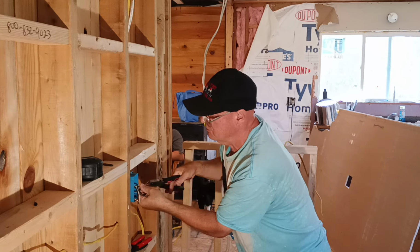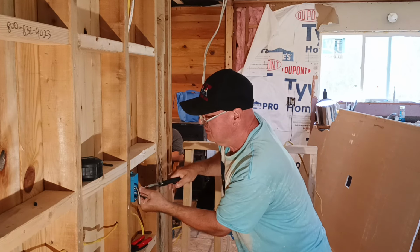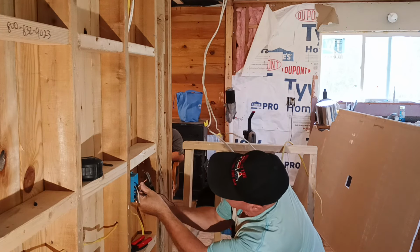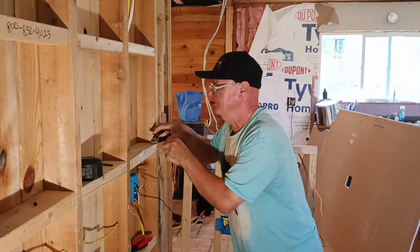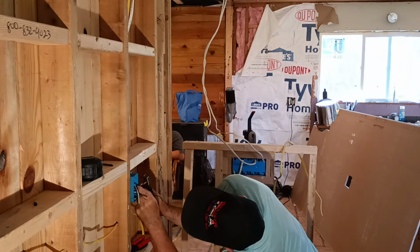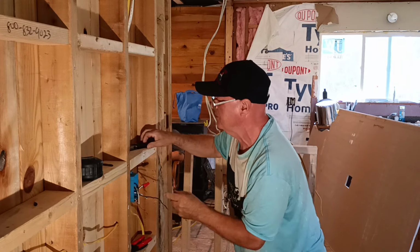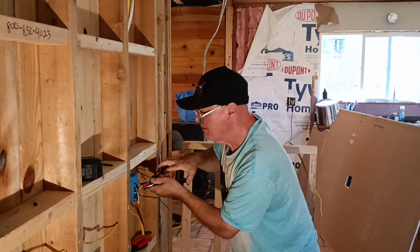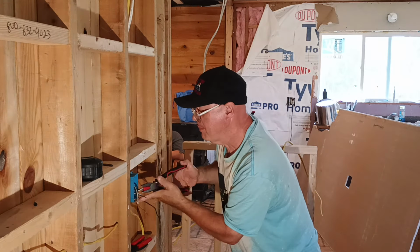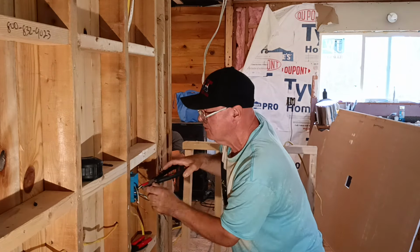Get our third one in here, get the insulation at the top. Clip it so they're all even on the end here. See all three wires even on the end there. Put our wire nut on. Shorter. Put our wire nut on, make sure insulation goes into the bottom of the cap there. I hold the tail so the wires all stay even inside the wire nut.